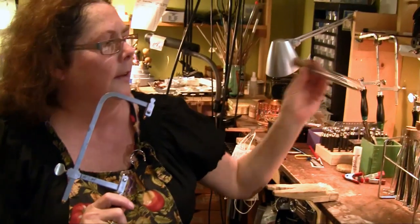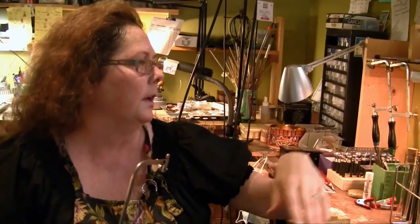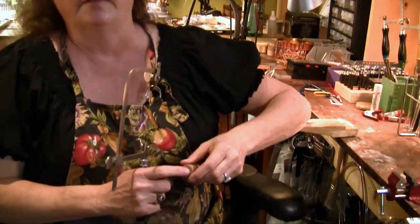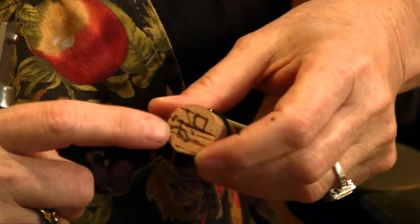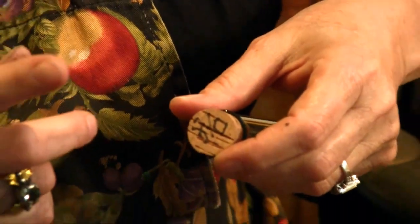And today we're going to talk about sawing and the things that you need for that. The first thing you need is a saw frame, and you need saw blades. The saw blades have this really bizarre system of numbering. They start at 7, which is the biggest, with big chunky teeth and big spaces between them, and they go all the way down to what's called 8/0. An aught is nothing more than a 0, and it's written like this, 8/0, but it's pronounced "eight aught." This is the smallest blade you're going to get.